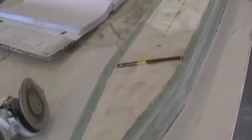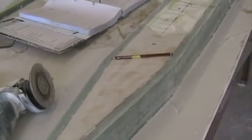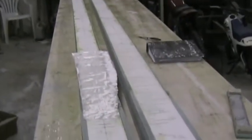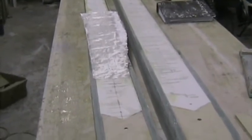With the spar flat on the table like it is now, I'm going to put on those four external 410 gram layers. Once they're on both sides, then it'll be time to wrap the spar. We have both spars laid out, ready for the external shearweb layers. 5 layers of that 410 gram glass, 45 degree, are going to go on the last meter of the wing.